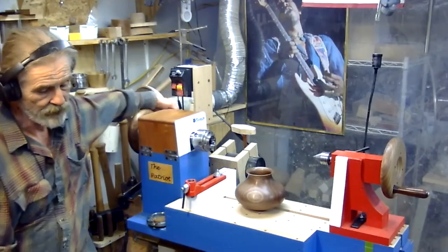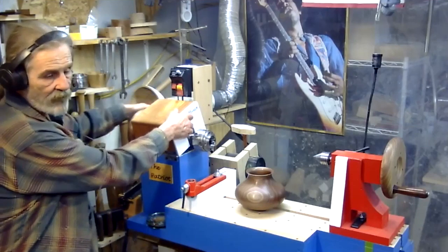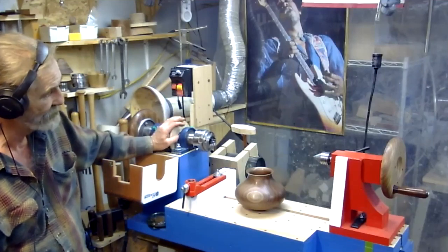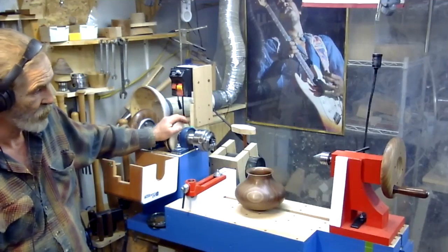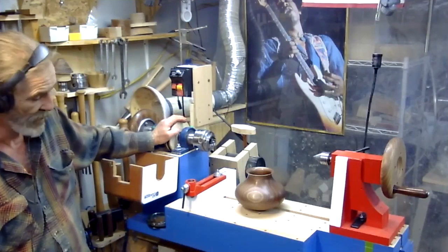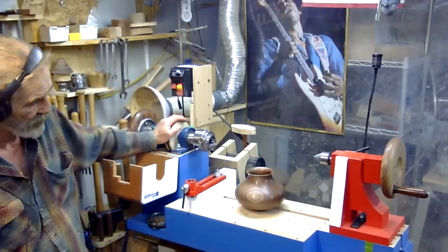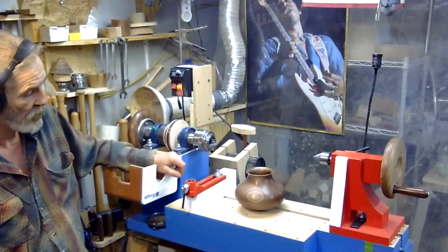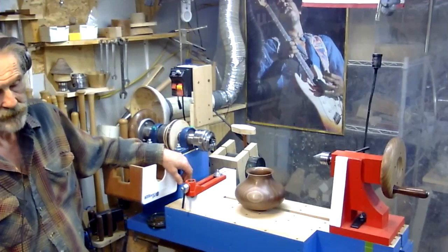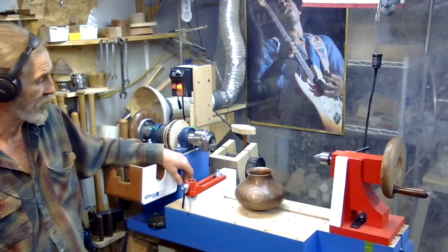The spindle pulleys I made from hard maple. And I know a lot of people think I'm going to kill myself, but everything runs beautifully. I've already turned one piece on it before I spiffed it up and painted it and everything. But the Rikon motor, I replaced the bearings, got it running, fixed the circuit board in the controller. The quill is from a 220 VSR Rikon. They forgot to heat treat them. Well, I got around that. Got that working.